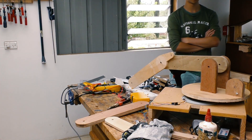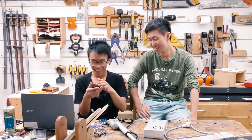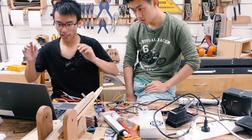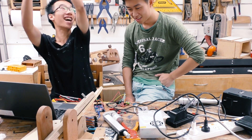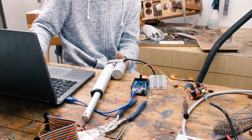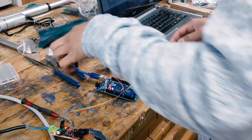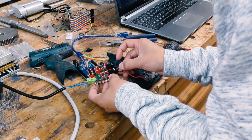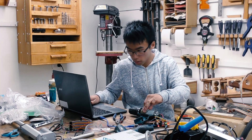This is where I took a lengthy break from the physical construction of the robotic arm and spent a week or two completely figuring out the electronics. For example, I tested out the linear actuators and also tried controlling them with motor drivers and boards and with the Arduino. Then there was the drill, used for the Z-axis — it was really similar to controlling the linear actuators since it's just a DC motor. I stripped the drill apart and controlled it the same way.